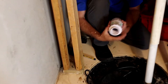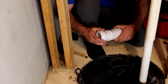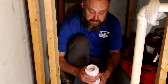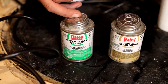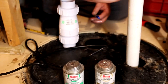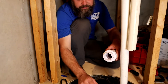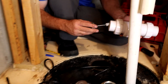We're going to install our brand-new check valve. It has a glue joint, and these are two unions you can take off. When you glue these up, you want to make sure you don't over-glue it, because you don't want to accidentally glue your little check valve door shut. So this is the primer and this is the glue. First, you apply the primer to the PVC pipe — that's going to soften the plastic. Then you do the glue next, and that's what seals it up. You just take a little bit like this and apply it on this side.